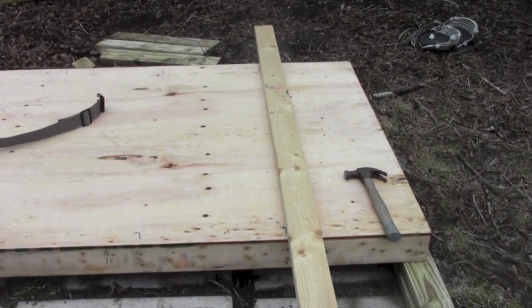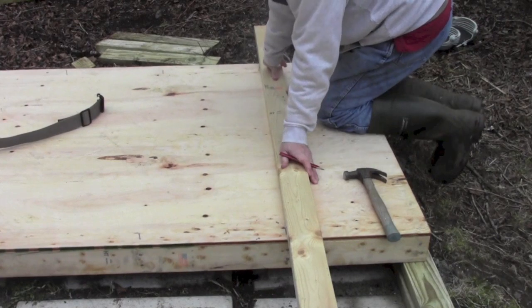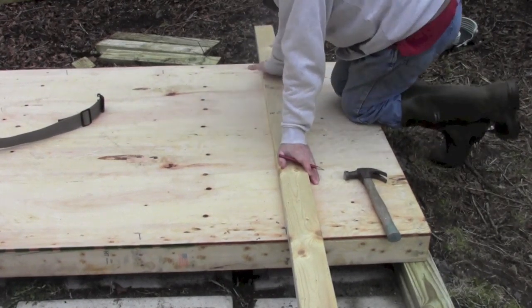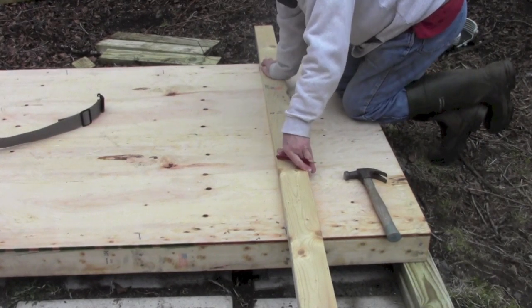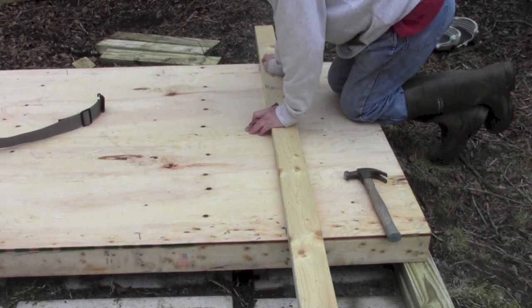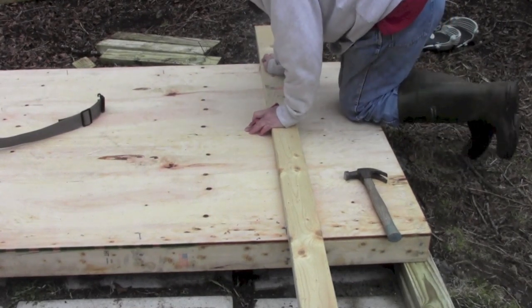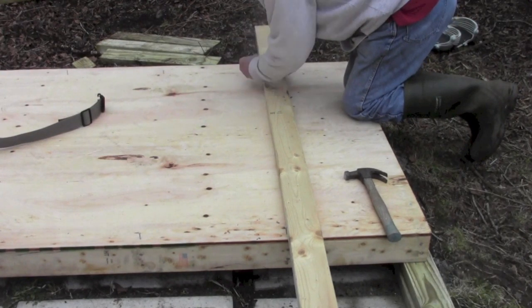Marvellous me telling you things about carpentry when I don't have a clue, but that is what sixteen on center means. I'm using half-inch CDX plywood — that's an exterior grade. There are cheaper products like particle board, but I've used it before and within two or three years it turns back into sawdust. I prefer to put a little extra money into it. I don't plan to put any shingling or siding on the outside, but I will paint it. Once I have the plywood tacked down on the corners and checked for square, I measure sixteen-inch marks and put a top and bottom nail.